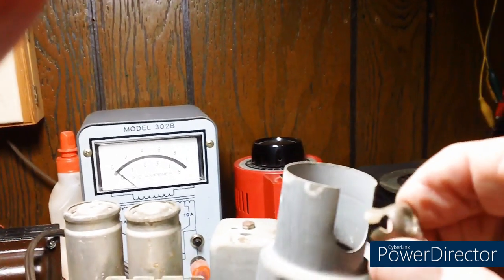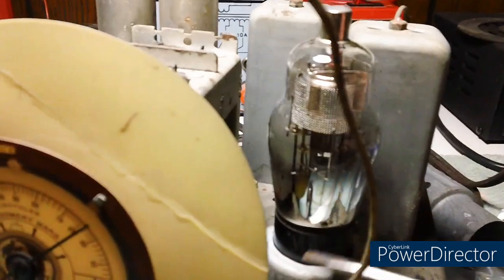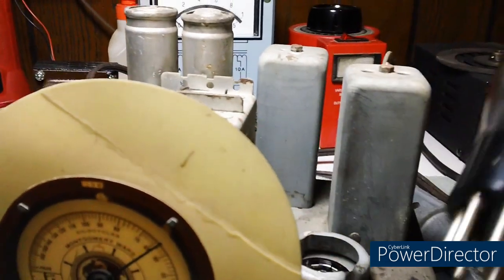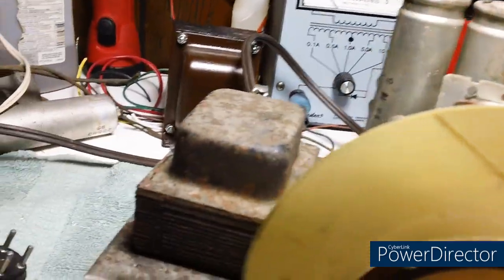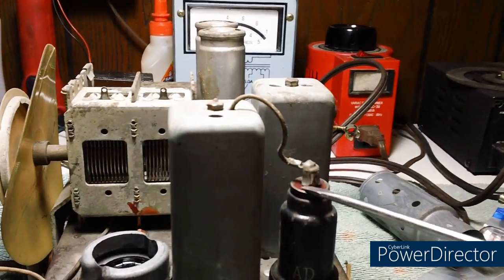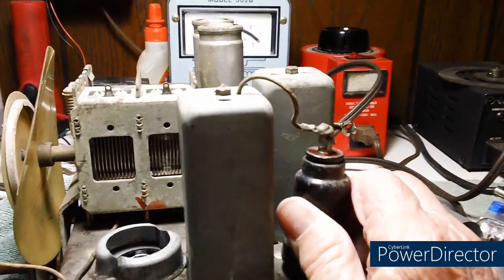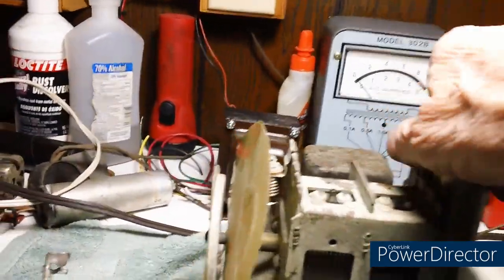There we go — got it off. Now we can take the tube shield off. This cap will have to be de-rusted and cleaned. The tube shield comes off, and now the tube is down in a collar. Grab the base, find out if it's loose — it's not loose. Now we can take that out. There's one more tube all the way in the back — another metal tube with a grid cap on it. These metal tubes are a lot tougher than the glass tubes. Wiggle them back and forth but don't wiggle so much that you destroy the socket. Now the radio looks almost empty already.